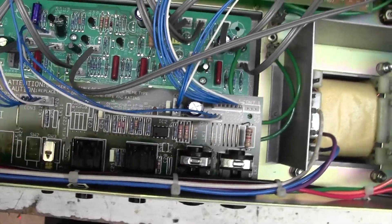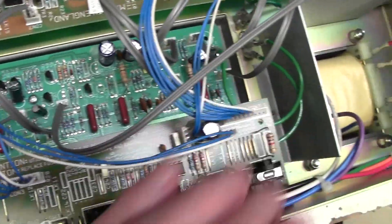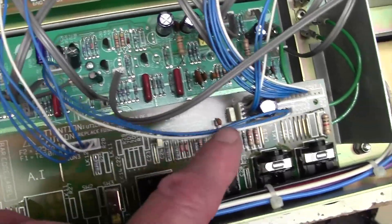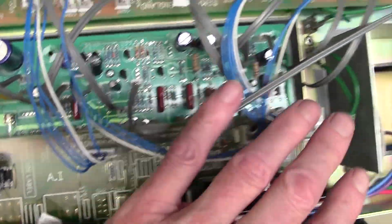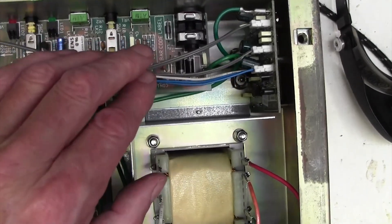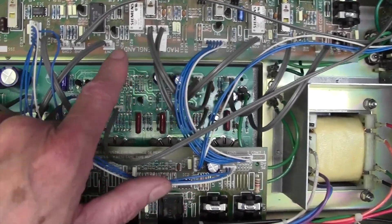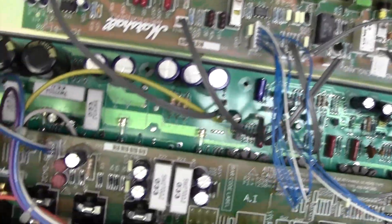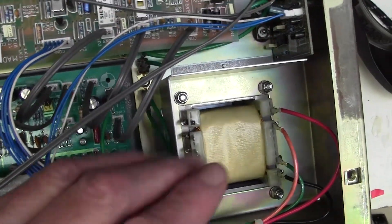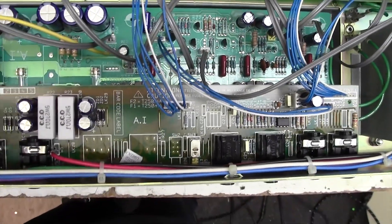To get to it and check whether it has a dry joint, we're going to need to remove this backboard, take all the valves out, undo all the screws holding the main board in, and hope we can just tip up this board enough to see what's going on underneath. I don't want to get involved in taking all these connectors off. These amps are in my view poorly designed from the point of view of reliability - you have all these inter-board connectors, each with many pins. I think I counted 200 connections once. You only need one pin to go wrong and you have a fault on your amp.